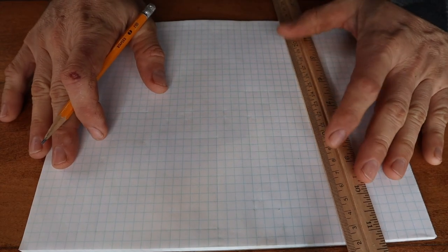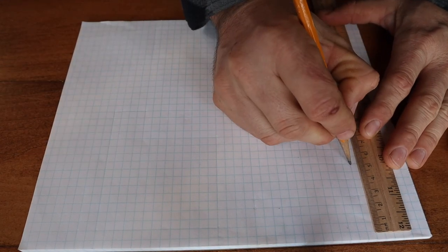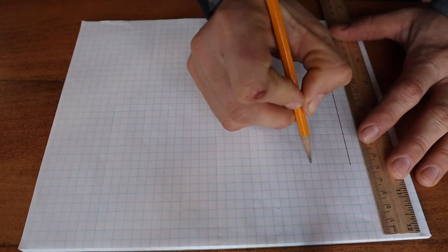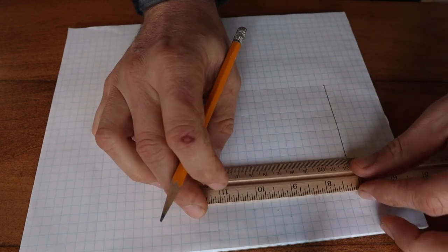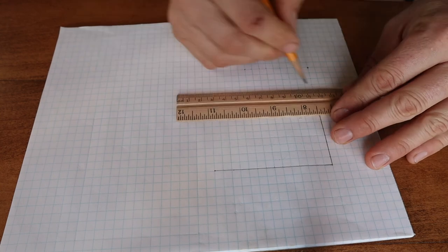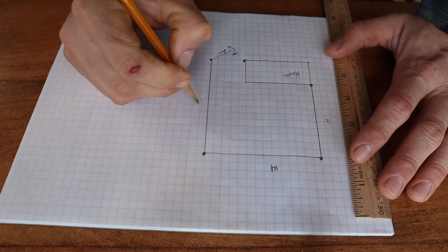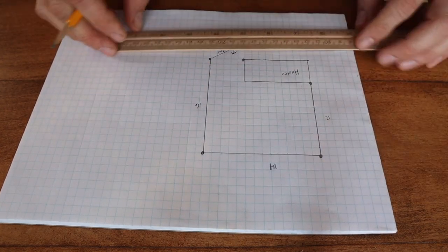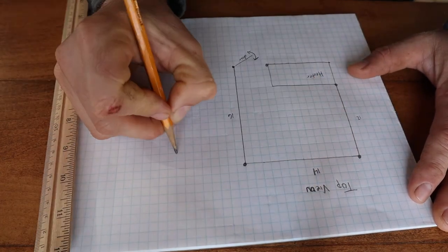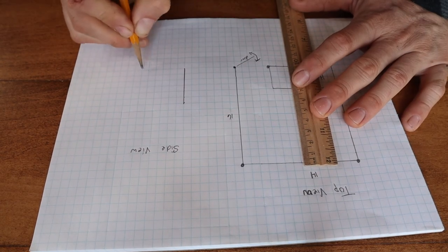All right, so here I am drawing out my greenhouse build and trying to determine the length of the lumber that I need. So I'm building this around our existing wood heater, and I'm just drawing out what I want it to look like. This is the top view, and I'll draw the side view in a minute. So the one side will be 7 feet tall and one side will be 6 feet tall. So I want it to have a foot drop from the top to the bottom. So let's go outside and get started.